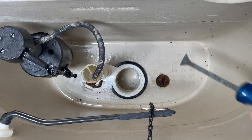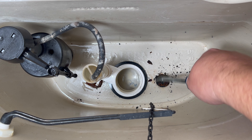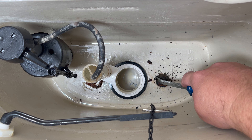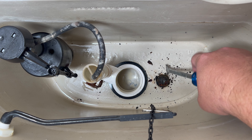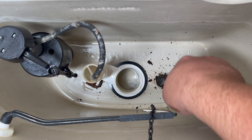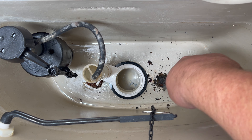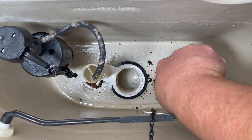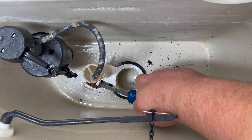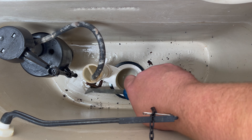I've got a little chisel here to break away this rust. This wouldn't be a problem if this had been installed with a stainless steel bolt set, but this is probably what came with the toilet bowl — what the plumber had at the time. You can see the standard slot right there; that should give me enough grip when I get the socket on the other side.